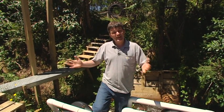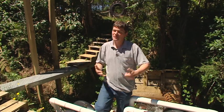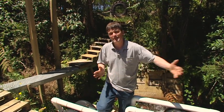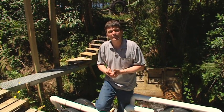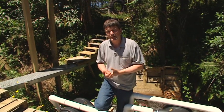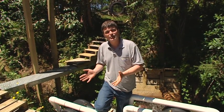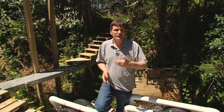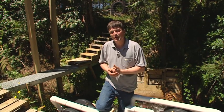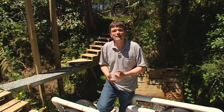And if you want a bigger hydro turbine, well, don't buy one PowerSpout, buy two, or buy five, or buy 10. So it's very modular, you scale it up, and the reason we do that, it's a lot more cost effective to put in two or three small turbines than it is to buy a larger one. Because not many people buy a 3 or 4 kilowatt hydro turbine. Most people buy a 1 kilowatt one, and therefore if you need more power, just put in more turbines.